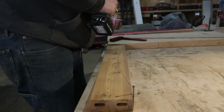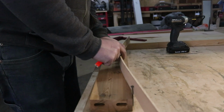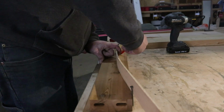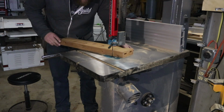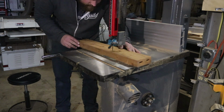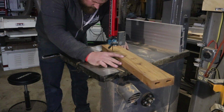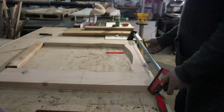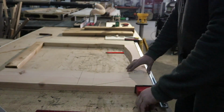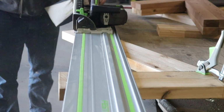To find the arch on the backrest, I use 2 screws and a thin piece of cutoff to draw it. You'll see this is a pretty nifty trick you can use anytime you want to draw an arch. I then use 10x50mm dominoes, and I use the cutoffs to clamp the arms together.